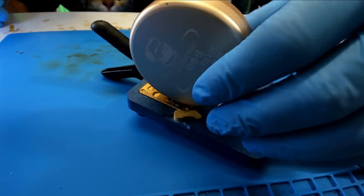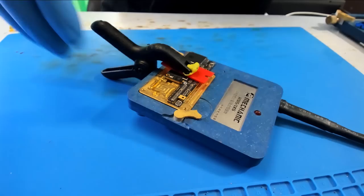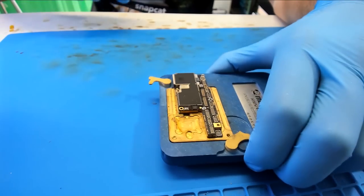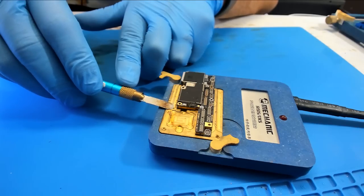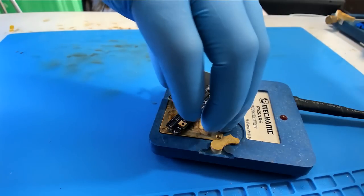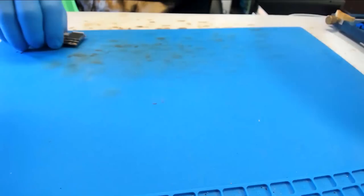All right, this is pretty well cooled down. We're going to begin removing our weights. Remove my much criticized clamp. We had quite a few people back in the beginning that told me, you can't clamp them down like that. You know what? They never came back for warranty, and that's largely to thank those spacers for. Those spacers are awesome. If you do have to do a full reball, it's probably worth your time to transfer those spacers over.